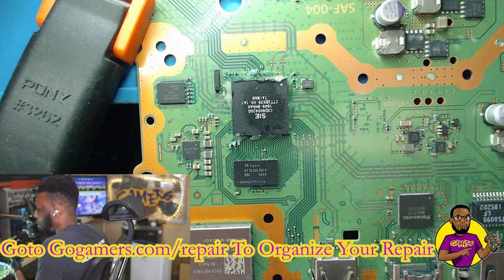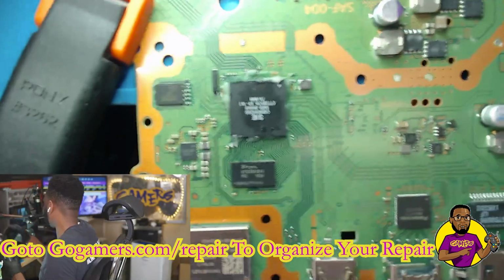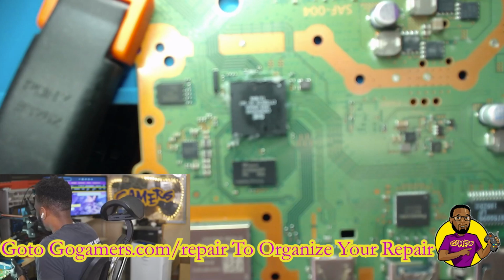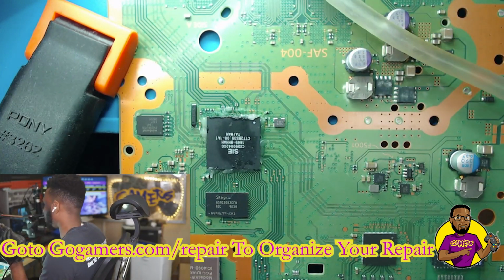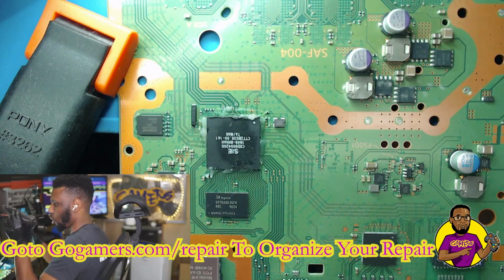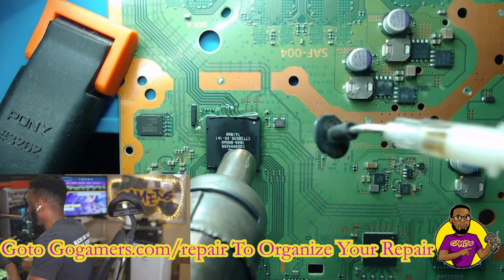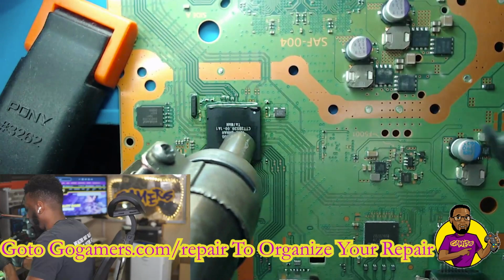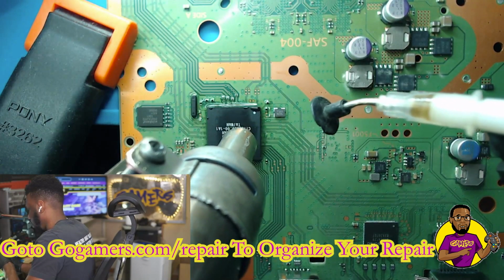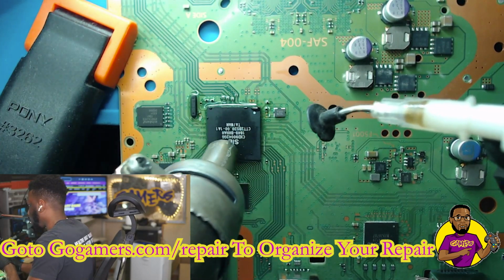I just applied 8341 no clean flux. What I'm going to do is take my Tular heat wand, put another tip on here, and we're going to get this thing heated up and take it off. All right, so I got my fume extractor going, my suction pump going, and my Tular heat wand going. Got it maxed out. I got my airflow set at 40%, because we don't need the airflow to be too crazy. Got it at 440.